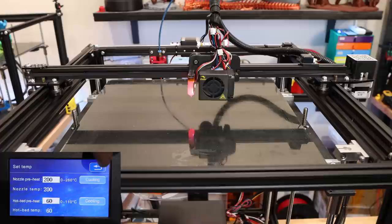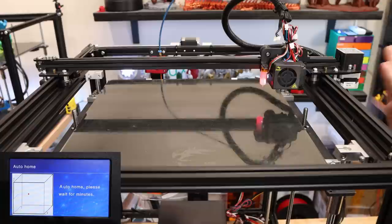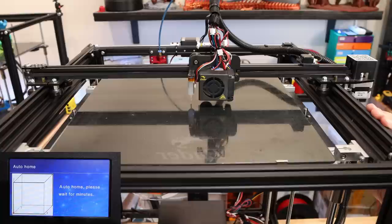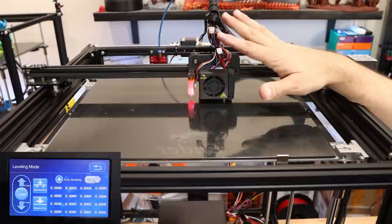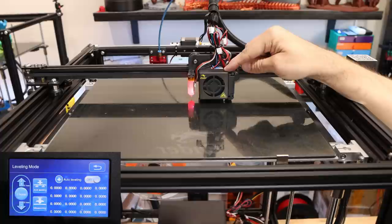We're all heated up and ready to go. I'll go back in the menu to Settings and straight to the leveling menu, which will home the printer — taking X and Y to this corner and then homing Z in the middle. Watch what the printer does. There it found the bed, but that really pushed into our printhead and that is not good. Don't freak out though — we're about to fix this problem.